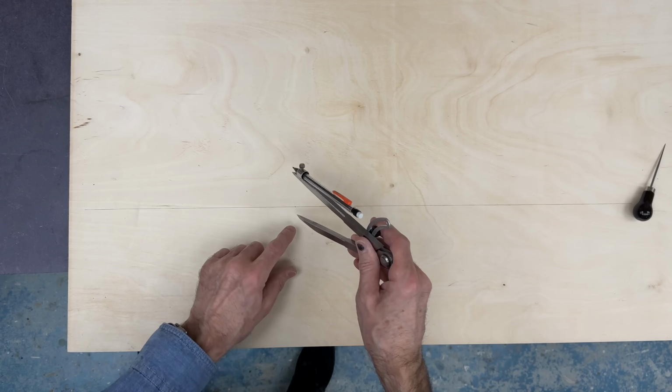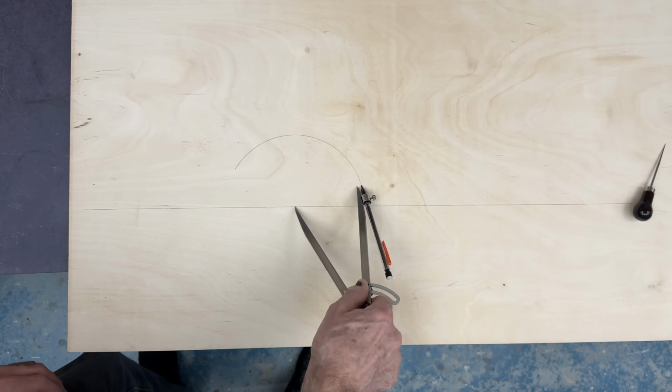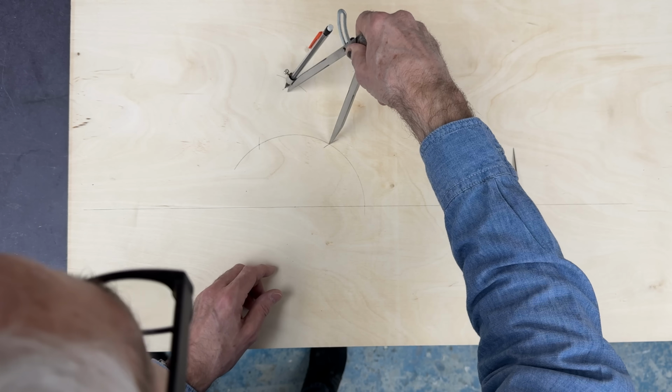And then you make an arc with the compasses. The actual size doesn't matter, but bigger is better. Then 2 more across that arc and 2 more again. And if you continue a line down from where the last 2 cross to the first point, then that line is 90 degrees to the baseline. Yeah, I said the video was easier to follow.